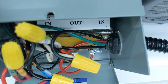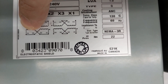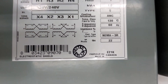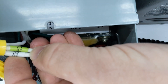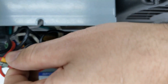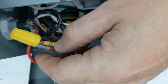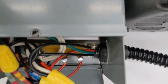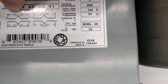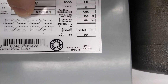While we're in here, let's talk about it real quick. For 120 volt input we needed to have X2 to X4 and X1 to X3. That's feeding our 120 volt in. Here is the neutral coming in and it's connected to X1 and X3. Here is our black wire of our 120 and it's connected to X2 and X4. Everything is grounded. Coming out of this we're going to make 240, per this diagram: H1 and H3 goes to one leg of our phase converter, and H2 and H4 goes to the other leg.